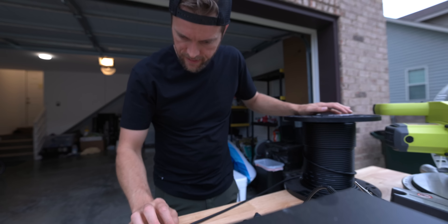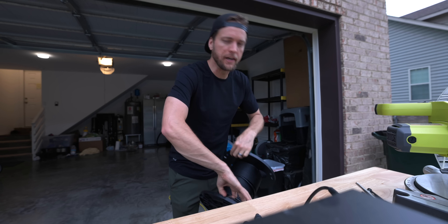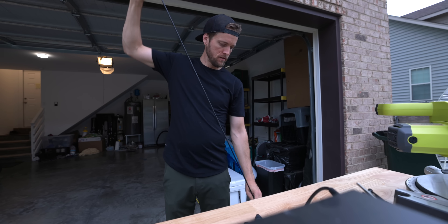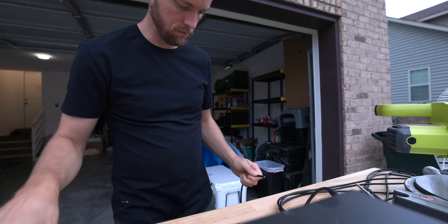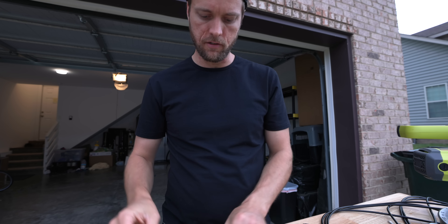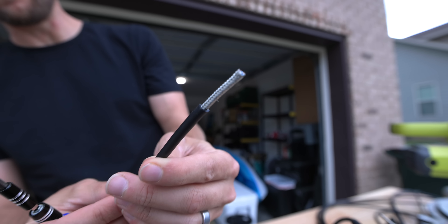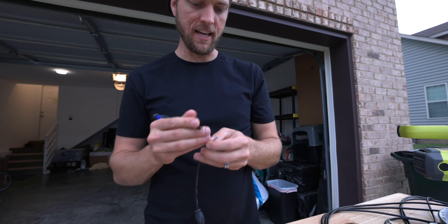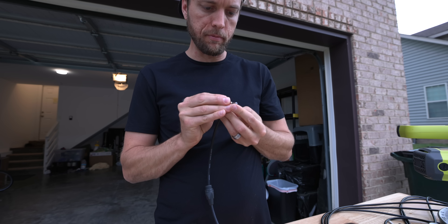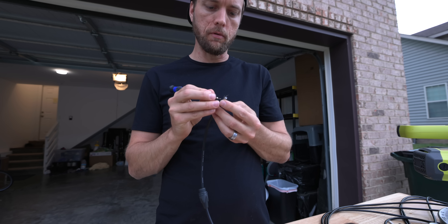I'll put links to them down in the description. Thank you, Sweetwater, for sponsoring this video. Now when I measure these, I do them very loosely. I'm going to do 20 feet — I'm about six feet tall, so I do them in wingspans. I'm gonna lay the spool down and just pull one wingspan. By the way, this kit is so useful for so many things in the studio — you should definitely have one. There are so many different little heads on here. This one is just a little pointy tip and I use it to unthread the ground. Look at the ground on this wire — it's literally braided. This is the strongest shielding ground I've ever used on any XLR cable. It takes a couple of minutes to unbraid the part you're gonna be soldering, but this tip works really well to open it all up.